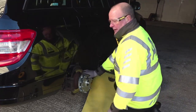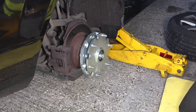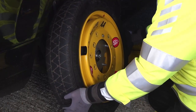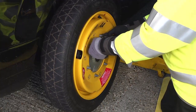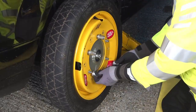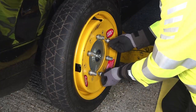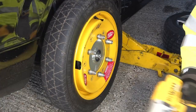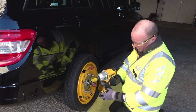Now that's on, nice and secure. The last job is the multi-fit wheel. There are two different sets of holes — get the right ones, which are the inner ones. Unlike the old multi-fit wheel or the smaller one, these are now flat nuts, so much more suitable for use with the DeWalt gun. Always start them by hand though — never put the nuts into the end of the gun and try to zip them on, because that can damage the threads. These will all be 19mm now the same. If the gun's on position one, just tighten them up.